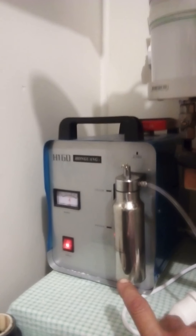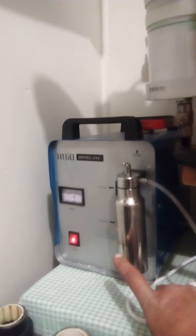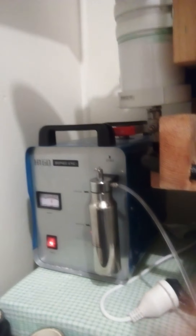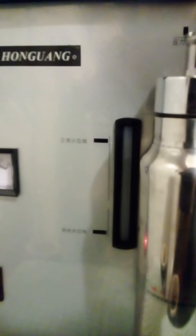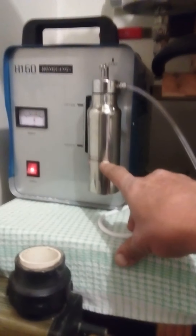But these will use caustic soda — 350 grams of caustic soda to every 700ml of distilled water. You're probably going to need about 1.4 litres in there. Don't fill the water line up more than the top level — at least half an inch underneath it — because it creates pressure and it'll overload. And again your water alcohol line acts like a bubbler system. That's pure hydrogen there, and that's guaranteed 75 litres an hour.